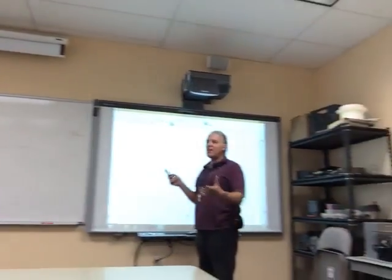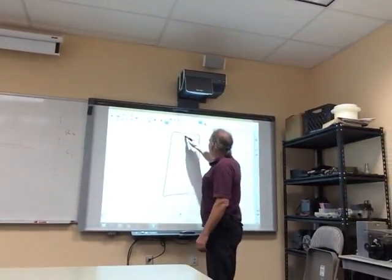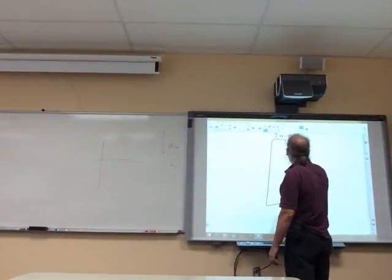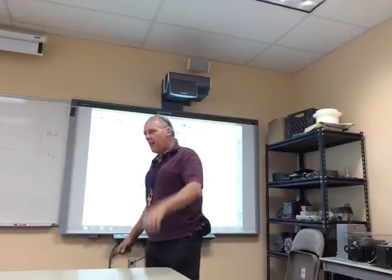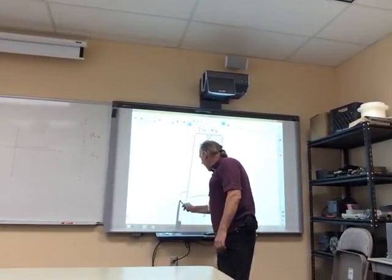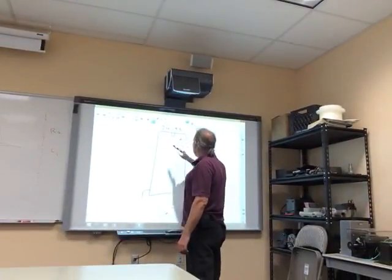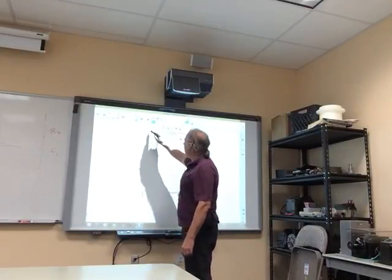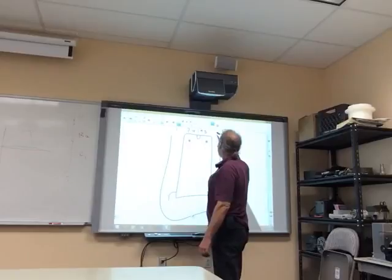Right, 74193, okay? It's got a lot of pins on it. But the two pins that I can always identify are the power and the ground. For most all TTL chips, the ground will be on the left side if you're looking at it with the little notch. By the way, some of them have a little circle here or here. But one way or another, that's the head of the chip. We count one and we go down and around the chip and back up, and this is the last pin. It might be 12, it might be 18, it might be any of those, okay?